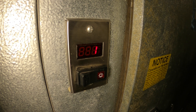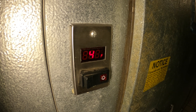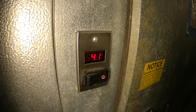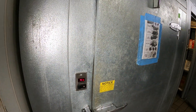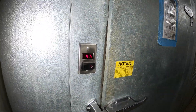We are just about where we need to be. We want to be between 35 and 40 degrees for a refrigerator, and we are now at 41 degrees. We're just going to wait for the thermostat to satisfy, but it looks like everything is good here. If anyone found this video interesting or helpful, please drop a like, comment, and subscribe as I come out with new videos every week. Catch you all next time!